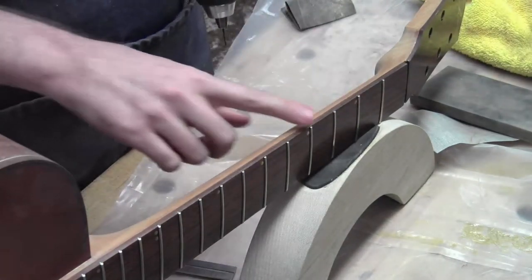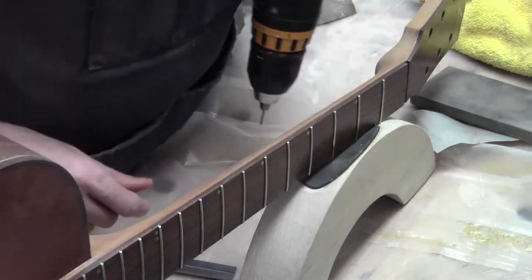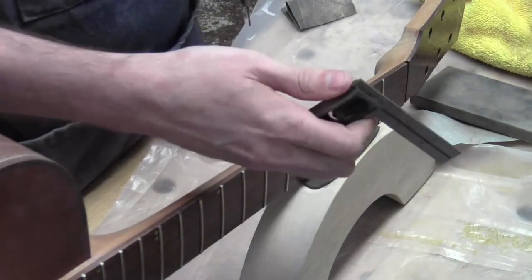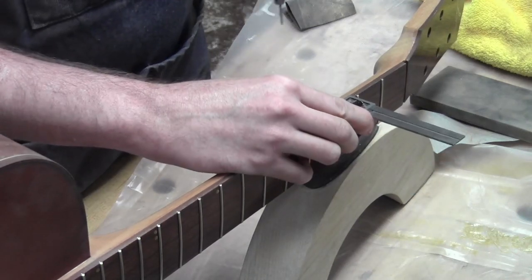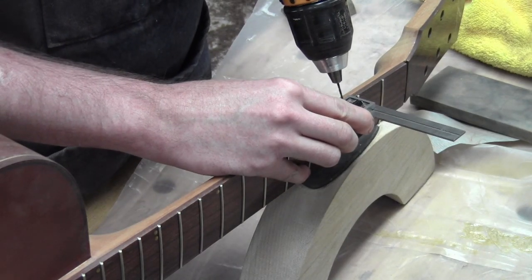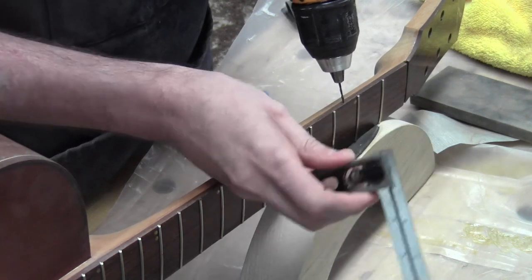I don't feel like I'm cheating or skipping out. I'm putting in the necessary effort and not more. I don't want to go overboard with precision on this because I kind of want this thing done. So I'm just going to hold my square up with that 16th inch or so stick out, which will basically put the bit right where I want it. And then I'll put the bit up against it, eyeballing where I want center to be. I would say that's pretty dang close to center.